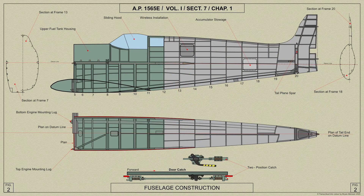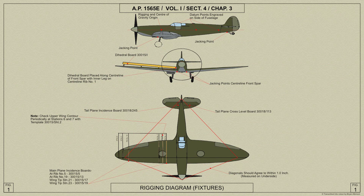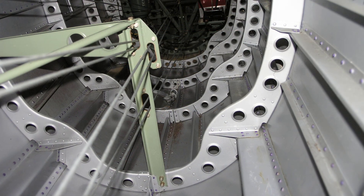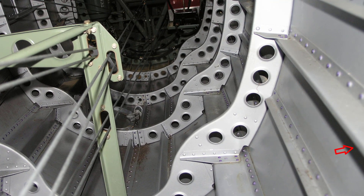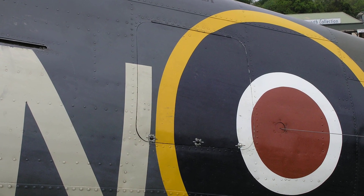The basic construction of the fuselage consists of 4 main longerons and 15 channel section frames of hoop or U-shape, numbered 5 to 19 from front to rear. The U-shape frames are forward of frame 11. The top longerons are fitted along the datum line of the Spitfire and carry blocks on each side of the cockpit for levelling purposes. The metal skin is of alclad riveted to the frames and stiffened between the frames by Z-section stringers, which are in turn riveted to the skin plates before the plates are attached to the frames.